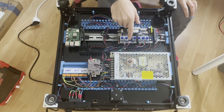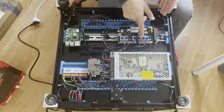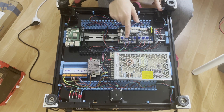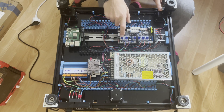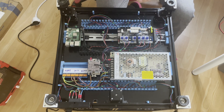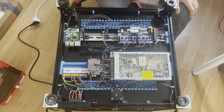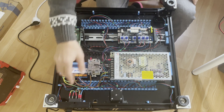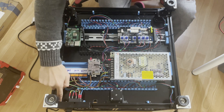In the stepper motors there are coils — you energize them to create a magnetic field which creates rotational movement. Comparing the Z motors, blue and red are on the left side but the order differs between the Stepperonline and Z motors. Since blue/red and green/black are paired correctly and in the right order relative to the Z motors, they should all move in the same direction. If not, we can easily invert the direction in config.